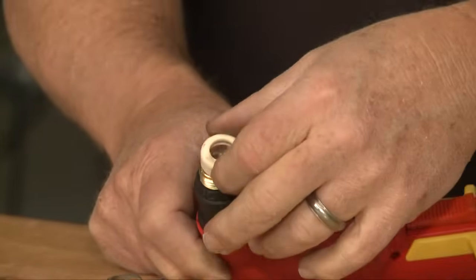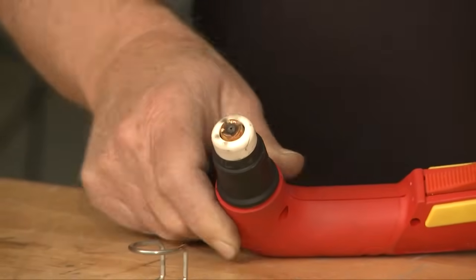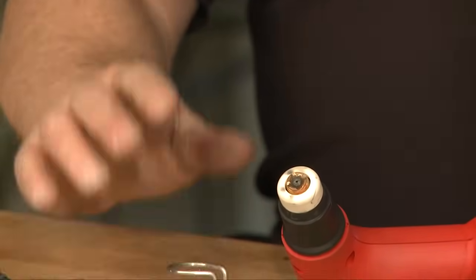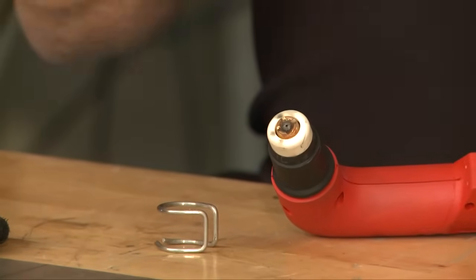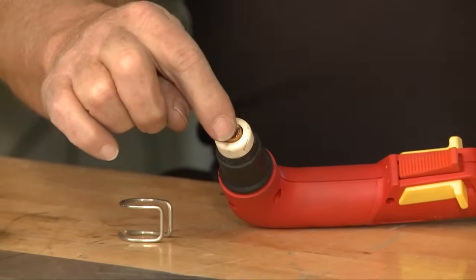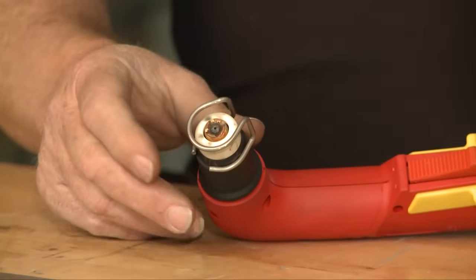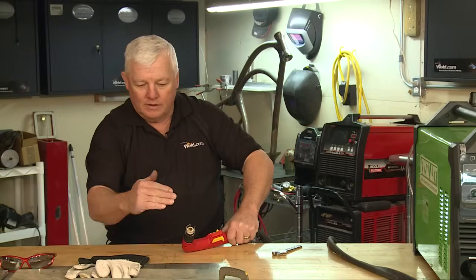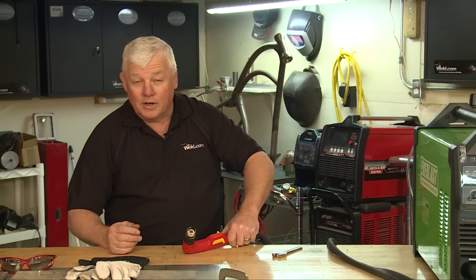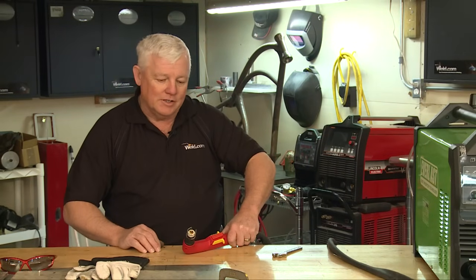I've got an insulator here that goes in place and holds everything in compression. Now there's one more component — a little offset tool. All it does is when you put it on your torch it keeps you from going metal to metal when you pull the trigger, and it'll save the life of this tip. I'll go ahead and put it on — you can see that it'll keep the tip up off the material you're about to cut. For some critical applications you can take this off, but you'll lose the life of that tip.